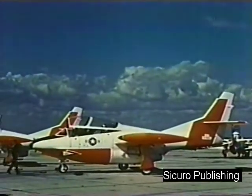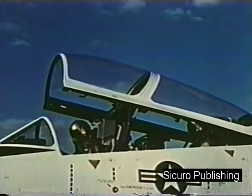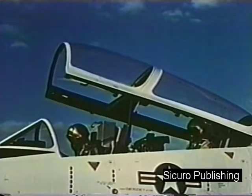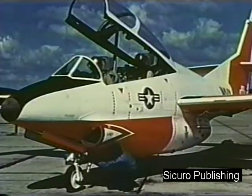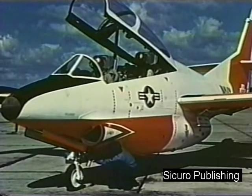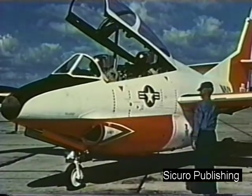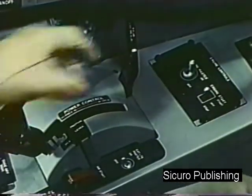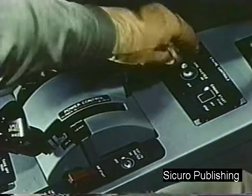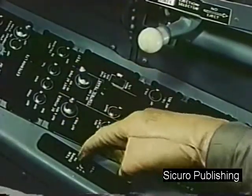When the aircraft has come to a stop, raise the canopy. The plane captain will chock the wheels and install the 3 landing gear safety pins. When you receive the cut signal from the plane captain, retard the power control lever to off. Turn the engine master switch and the DC power control switch to off. Turn off all electronic equipment.